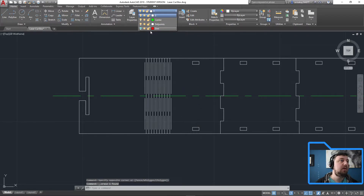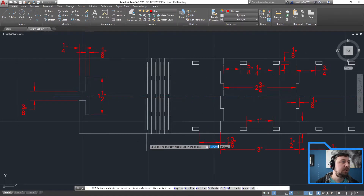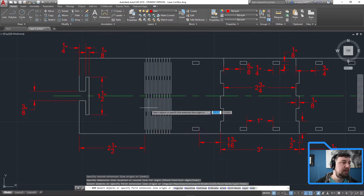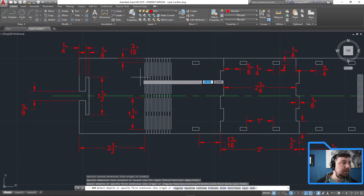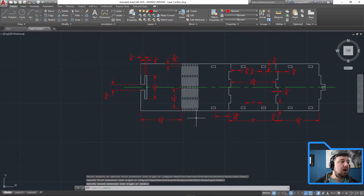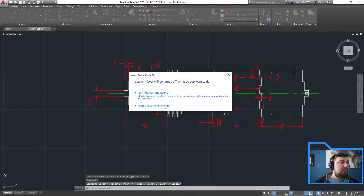Good work — that's our array for the living hinge. Let's do a quick double-check: from that point down to that point we have 2.5 inches. From here to here is 1.25. Checking the gap — three-sixteenths rounds to our decimal. And between: clicking that to that — one-sixteenth. Yep, yep, yep.